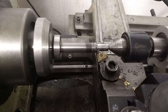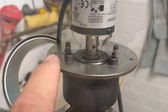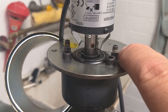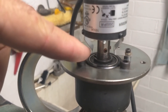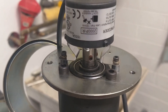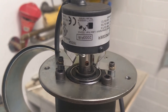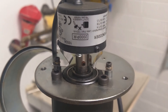The shaft I turned down to 8 millimeters. When I took the brass disc off you can see how big it was. There are spacers on either side of the encoder mount to space it up off the plate. These encoders can account for a little bit of misalignment — there are little spring steel mounts so it can account for any small misalignment. I checked the runout and I had about a thousandth, which is well within the tolerance of this encoder.